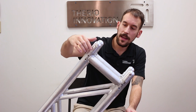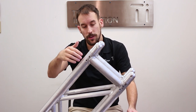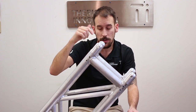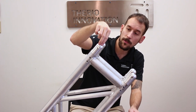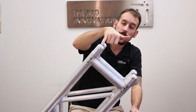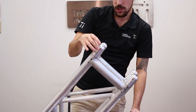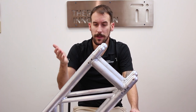When you look at the spigot, check the holes and the spring pins — make sure they're still in the right position and that the holes are not stretched from too much weight, as shown in the last video. The holes should still be pretty circular; you'll have the measures in the document. Also for the female spigot, make sure it's not bent in or bent out — for example if it gets stuck in a truck and gets pushed out. After that, look for any corrosion or anything that could damage the properties of the spigots, and check for cracks.